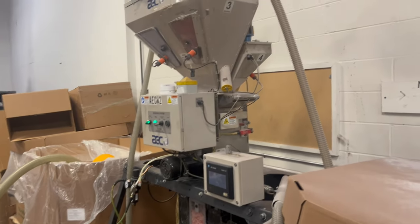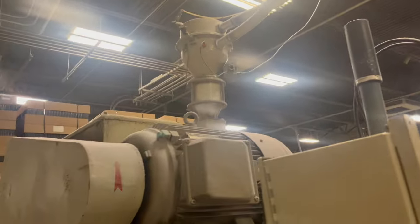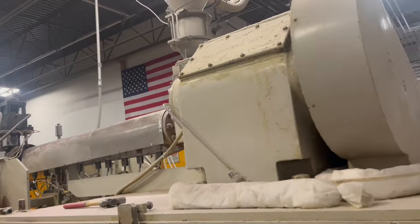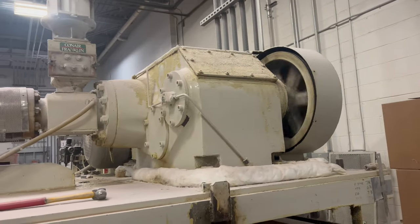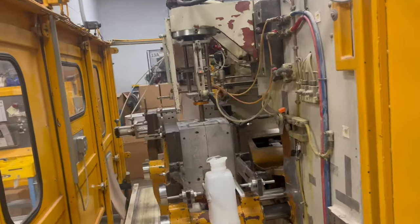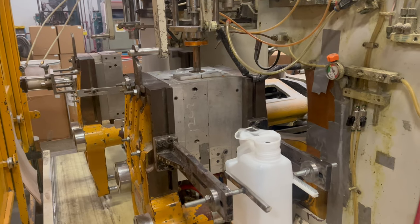What we're looking at here is a material blender for this machine. It'll come out of that blender, go up through all these vacuum pipes and find its way into this hopper on top of the extruder. That shroud covers all the belts for the gearbox that runs everything. Once the power is driven through that electric motor, it spins a screw inside of this barrel here. That is the sprocket that does all the work. Once the plastic goes through that screw and gets plasticized, it comes through the head and comes out in the form of a parison that we then turn into a bottle.